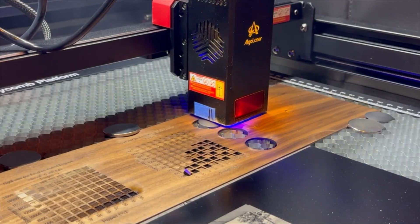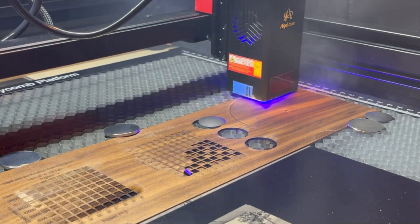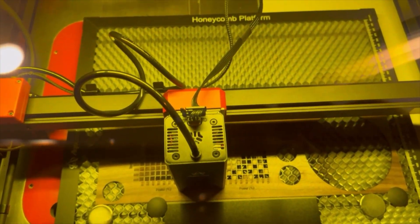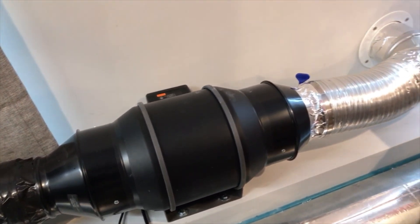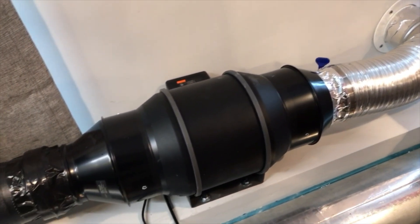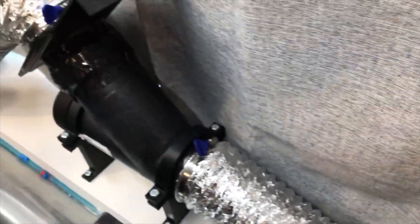It's critical that you exhaust the fumes from your laser engraver because you don't want to be breathing smoke and other contaminants. An enclosure is included in the safe kit, which I feel is critical to manage fumes, but it should be secondary protection — always wear your laser goggles even with the enclosure. I purchased and installed an AC Infinity 6 inch inline exhaust fan generating 400 cubic feet per minute airflow. It has 10 speed settings and is relatively quiet. I made a permanent installation through my wall, but you could also install a panel in a window.